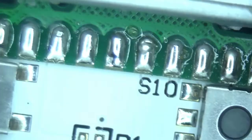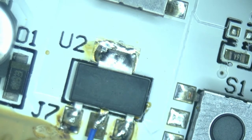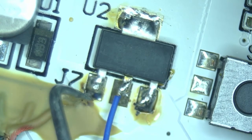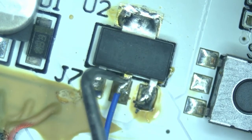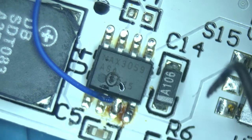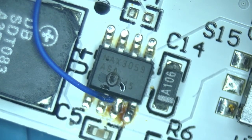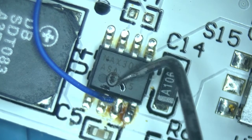Under the microscope, I'm going to examine these areas and see if there's anything that jumps out. You can see over here that obviously this was added after the fact — there's some soldering after everything was put together. They run a jumper wire from the pin over to this chip. This chip over here is the CAN transceiver — that's the one that connects this display to Apex and allows Apex to talk to it.